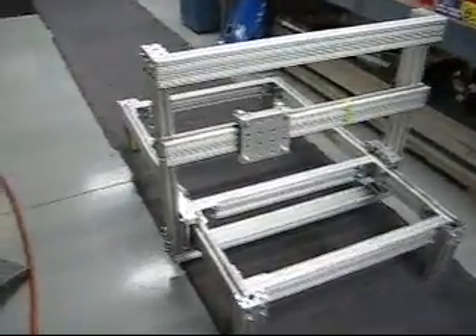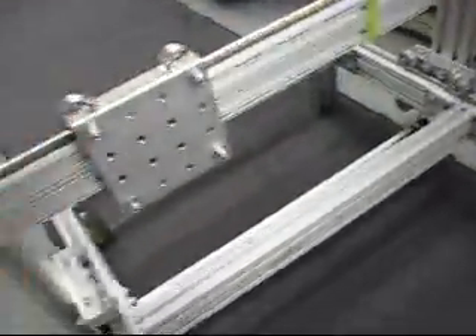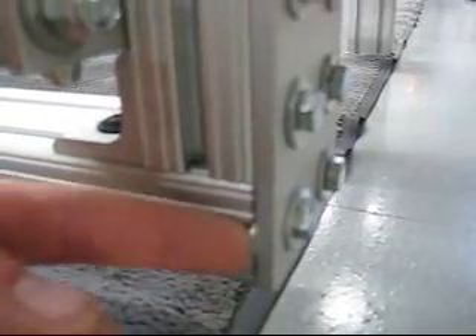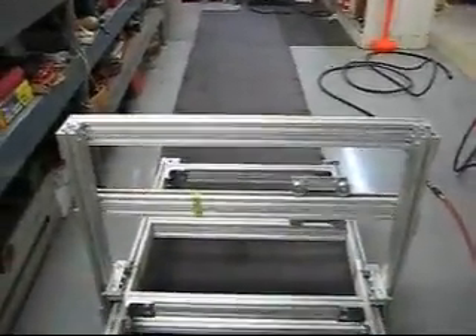A little update on what I've done so far — we've got two axes made. The bottom piece of the gantry I had cut just a hair too short, so there's a gap, and I used automotive alignment shims to fix that. The two other pieces I cut to the right length, so when it's all bolted together the vertical arms of the gantry come up parallel to each other at the top and bottom, which is pretty good.